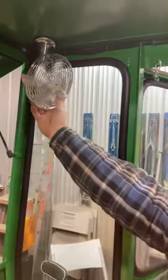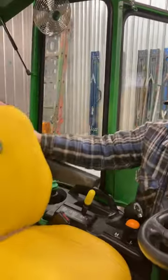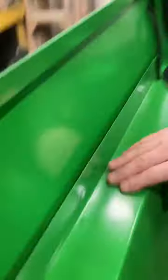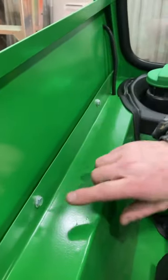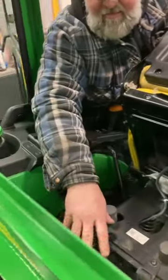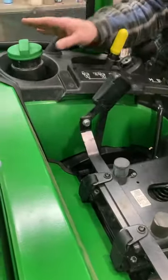You can put that wherever you want — I like it about right there. While we're in here, this is a removable panel. When you want to service your hydraulics, the fill location is right where my finger is. Instead of cutting a big hole, it's much easier to simply remove these three bolts with a 7/16th wrench or socket, and that's going to come out very easily so you can access all your fill locations.